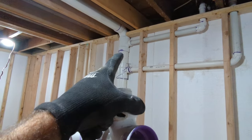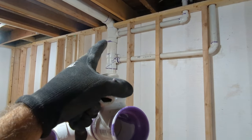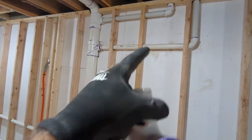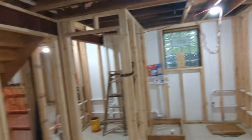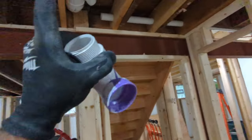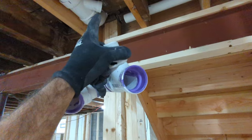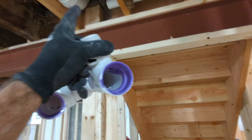And like this isn't really... I don't know what counts here, because you've got a wet stack and a dry stack, or dry vent and wet vent. So this is a wet vent, because even though you're pulling atmospheric pressure to chase this moisture down, or this water, whatever you're washing down there, you very well may have water coming from above. Same goes upstairs. All the way up to where the upstairs bathroom connects into it, there could be stuff falling down. So to some extent, I think that's all a wet vent.